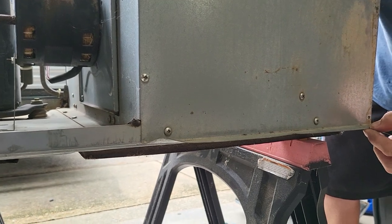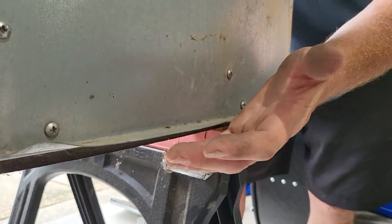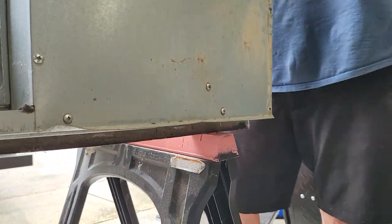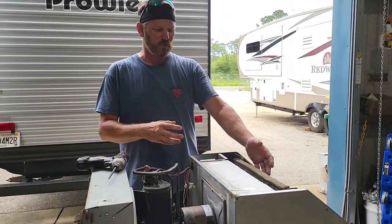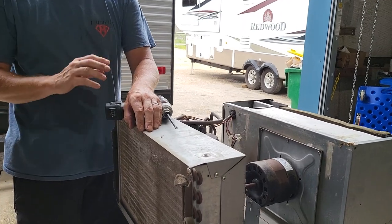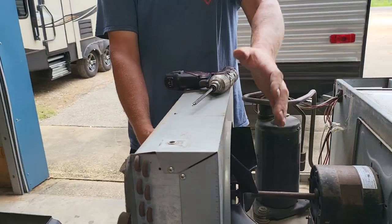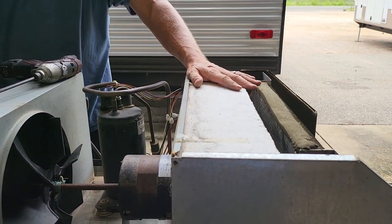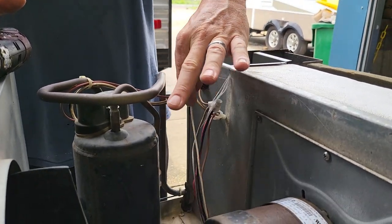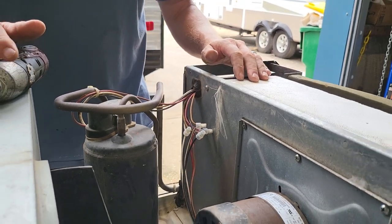On the Coleman, there's an extremely sharp galvanized piece of sheet metal on this unit. If you're changing a gasket or lifting it, do not tip it sideways on your rubber roof — it will cut a big slit and cost you dearly. As for all that heat pulled into the refrigerant: it comes over to the condenser coil, where the refrigerant is superheated. The condenser fan sucks air across this coil to cool the refrigerant back down so it can be compressed again and sent through the evaporator. I also noticed someone replaced the fan on this unit — it's not factory; there should be no connectors on continuous wiring.